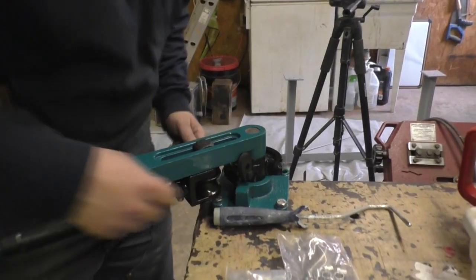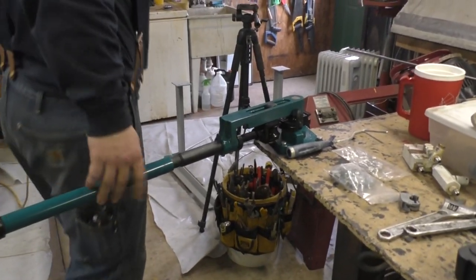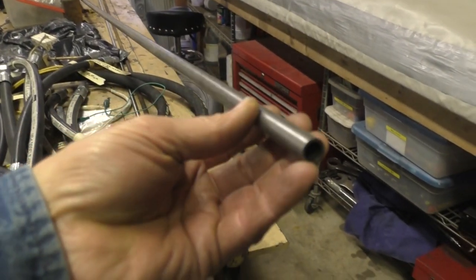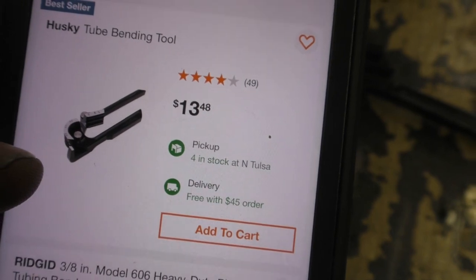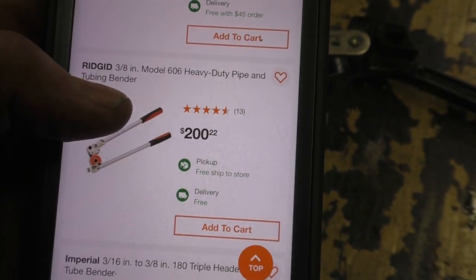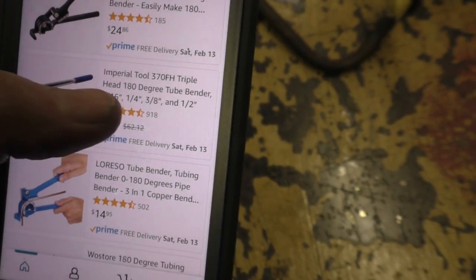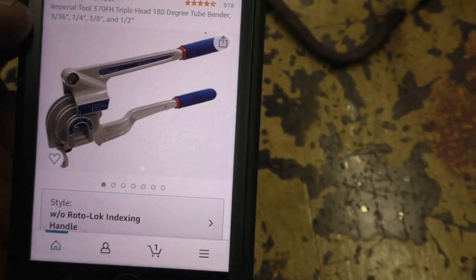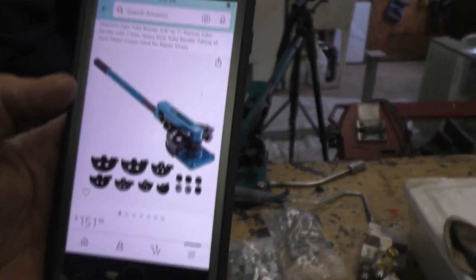When you've got to go bigger, you go bigger. We've got one of these — it's actually a pipe bending tool but it will work for tubing if you're careful. You'll need a bigger pipe bender for half-inch pipe, especially stainless steel. That fourteen-dollar tubing bender Andy broke, so that's why it broke — we need to put a little more money into it. I like this tubing bender that goes up to half inch: three-sixteenths, quarter, three-eighths, and half — this should be harder to break.